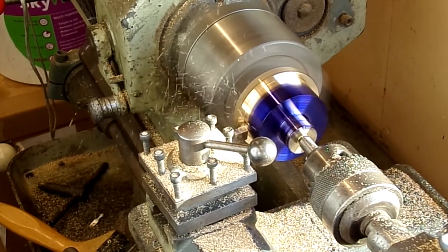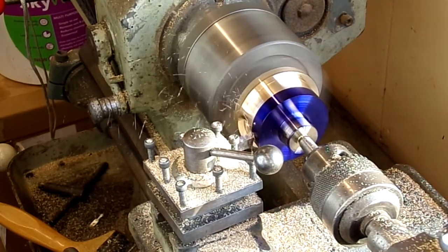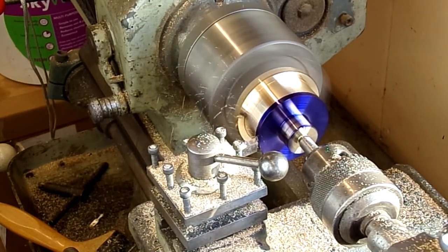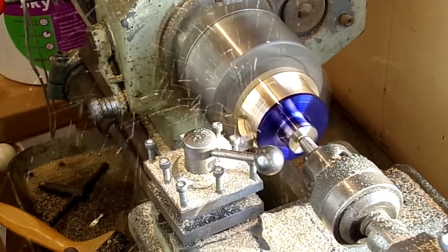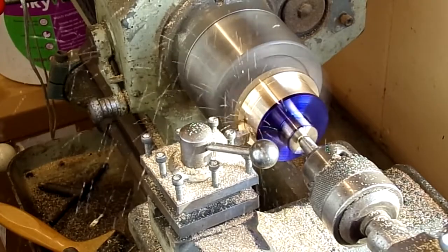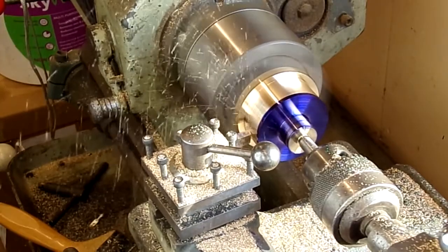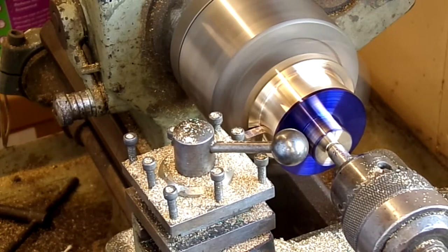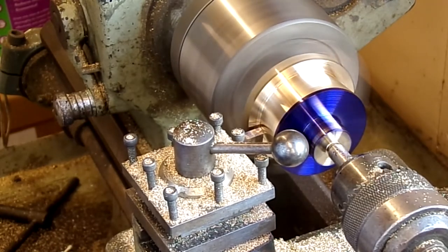Here I am using the angle of the tool — I'm going to cut backwards and forwards, but the angle of the tool is actually set at 2 degrees to cope with the taper measurement which I got from the hub itself. Backwards and forwards a few times, and here I am doing the final touching to get the taper smooth.